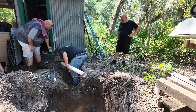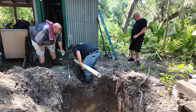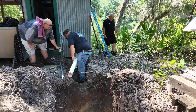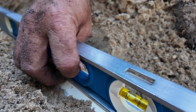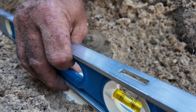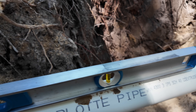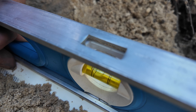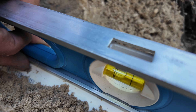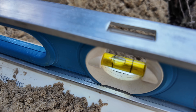He is making sure that the drainage is pitched. What kind of degree pitch are you looking at? One eighth of an inch to the foot. You want to pay attention to this — it's important. If you pick up the level, I should have about an inch down at the end, which gives me an eighth of an inch to the foot. That way the poop runs down with the water and the water doesn't outrun the poop. If you go too steep, the water will outrun the solids and they'll just sit in there.